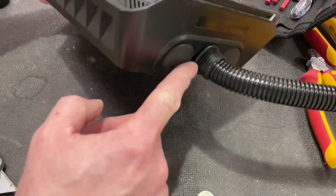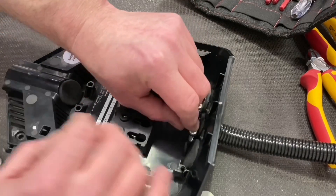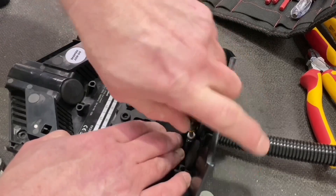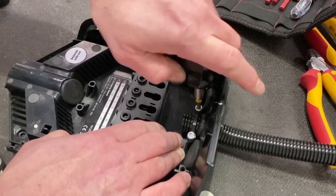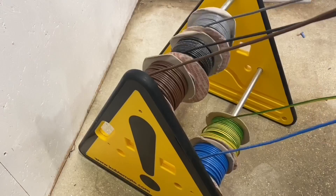It's gone in exactly the same as any grommet would - held into position with a clamp on the inside. People might think they could use a standard gland there, but those holes are angled towards the back of the unit, so you'd struggle to get clearance. Nip the screws into position with the appropriate tightness not to crush the Flexicon - nice torque screws. I wish we'd use more of them in the electrical industry.